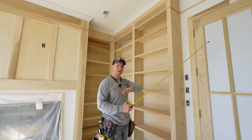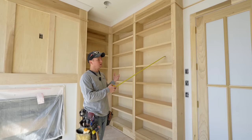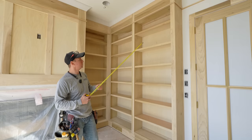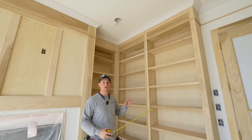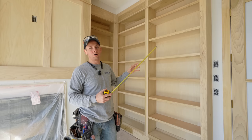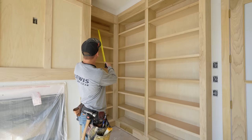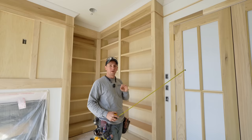Here you can see, if you take a close-up of the joint, we've got lines on one side and lines on the other side. Up here in the library, you really can't even notice the splice — we've got three dominoes in there, it's sanded out really nicely, and it's going to paint up really well. I always sand with a hard pad on my Festool sander so it's silky smooth. I also wanted to point out you'll have the same issues with your back plywood — I opted to put the plywood splice up across the top and added a trim piece going all the way across, which gives it a nice accent around the room. Plus, these bookshelves are going to be covered in books, so you won't even see that trim piece anyway.